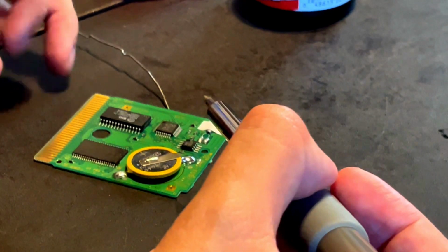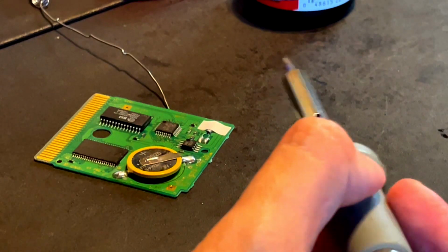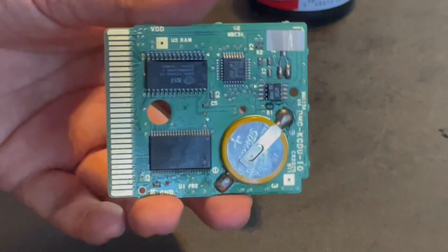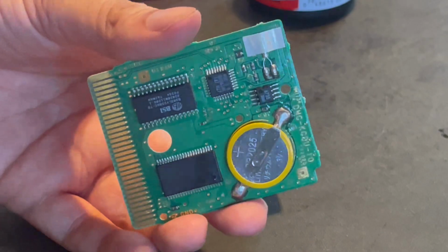Have a lot of patience in applying the iron and spread it around in order to make the proper connection. Then once you finish sticking the battery in its place, I usually wiggle the PCB board around to ensure that the battery cannot easily come off. You can tell afterwards that it's where it's supposed to be.